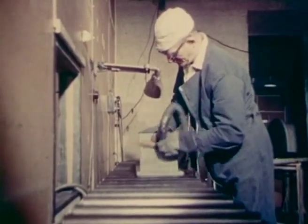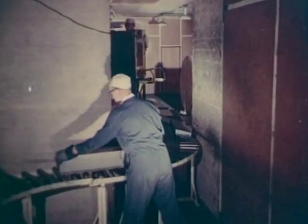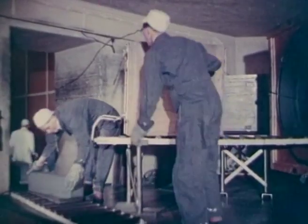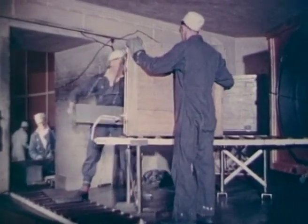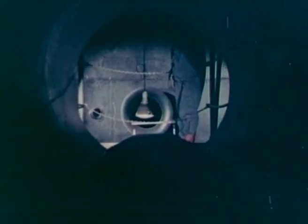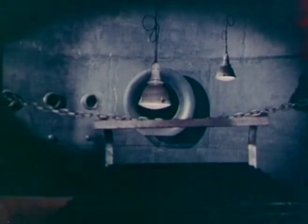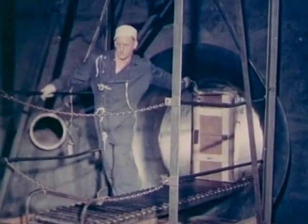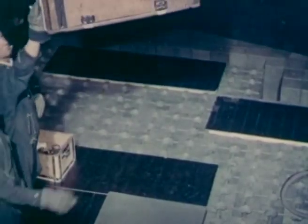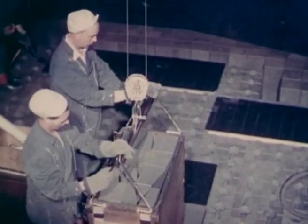Far below, work started on the intricate task of creating the heart of the reactor — the furnace to draw heat from the new fuel of the atomic age. Graphite bricks were loaded onto skips and passed down one of the gas ducts into the pressure vessel. The utmost cleanliness was essential; every man changed completely into a clean set of overalls each time he went on the job, and wore felt gloves to prevent any trace of moisture being left by his bare hands.